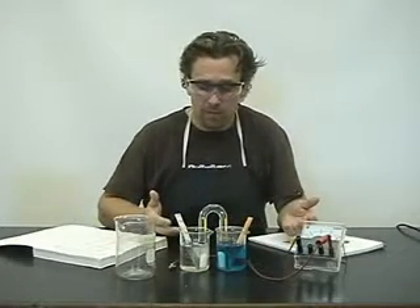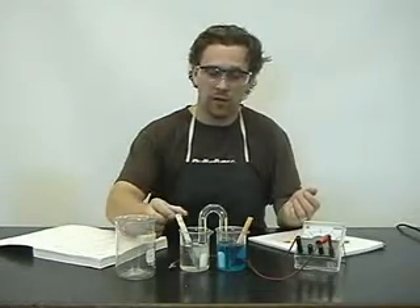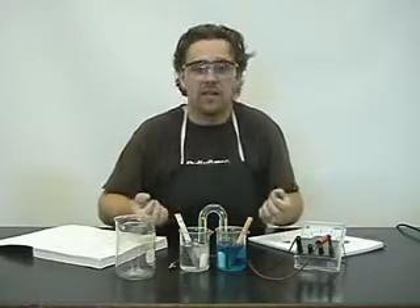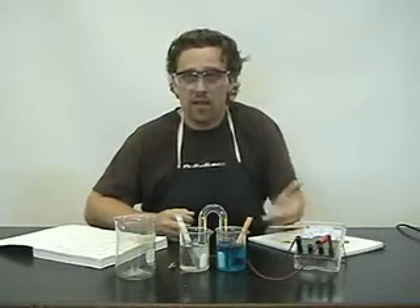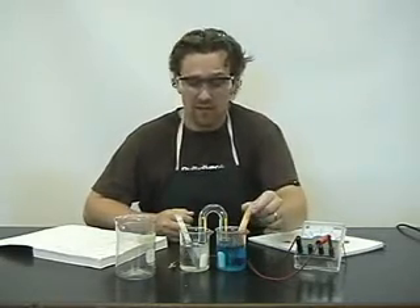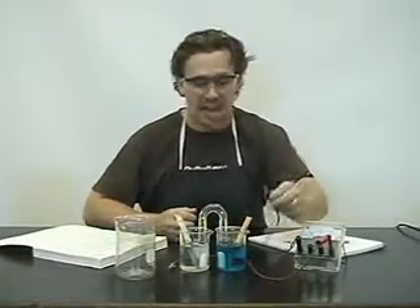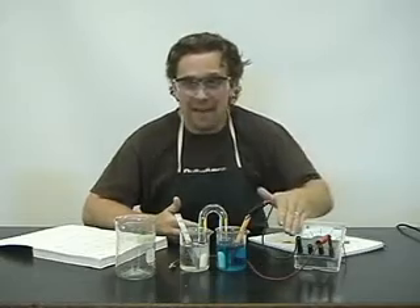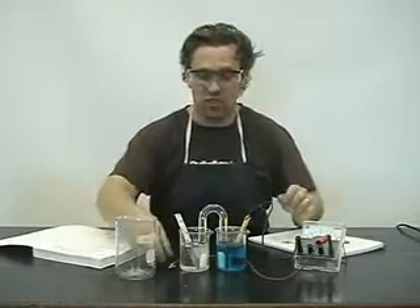That still doesn't fully solve our problem. We know the anode and the cathode attract different ions. The cathode attracts cations — positive ions. Well, if the cathode likes to attract positive ions, it must be negative. Therefore, we hook it up to the negative terminal. Now, don't worry — if we hook it up wrong, what'll happen is we'll get a negative voltage, indicating that we've done it wrong. That's a nice little check.